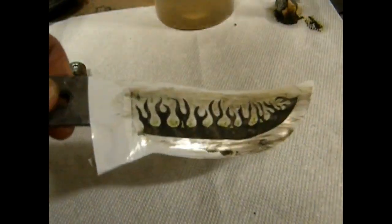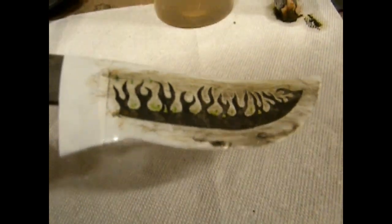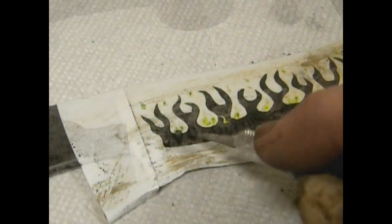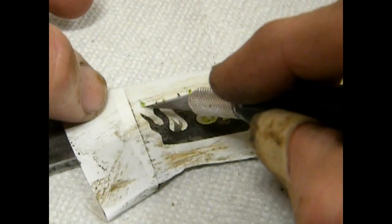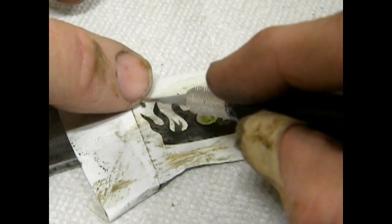When I'm done with the etching, I'm going to moisten a paper towel and very lightly take a look at how the etching is going — wipe away all the dirt and run my finger along. You can feel that the etching is actually deep into the steel. If it wasn't, you can certainly go back and re-etch it at this point. Now I'm going to peel those background flames using a razor knife or tweezers, and I'm also going to peel all of the floating embers that I had drawn in earlier.